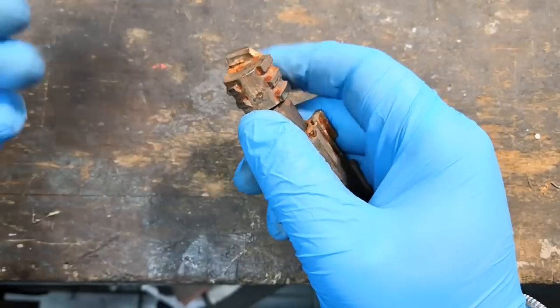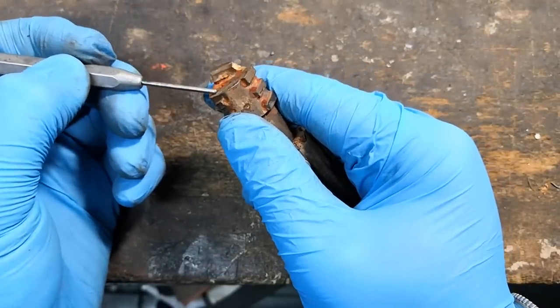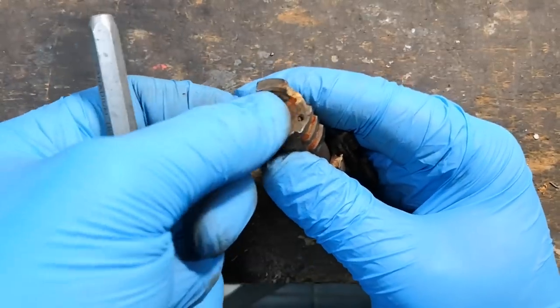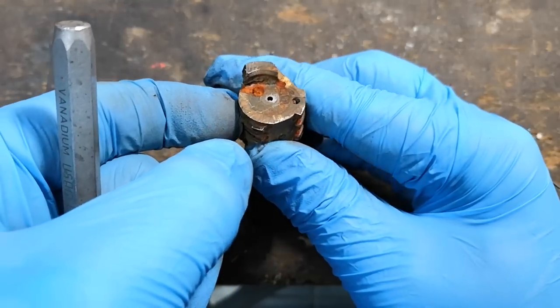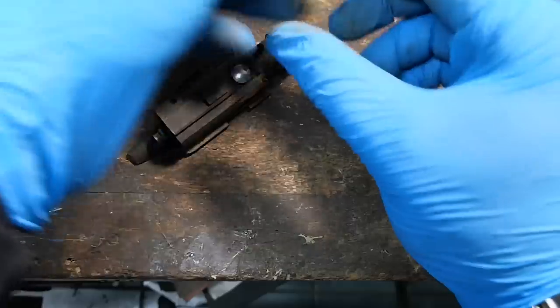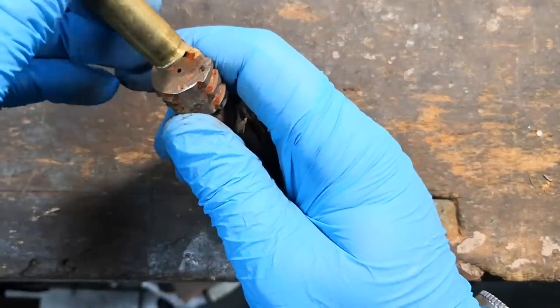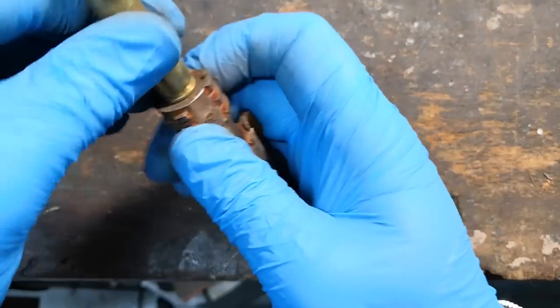We know that the rifle had already fired many rounds before the accident, and had been regularly proof-tested to a pressure 25% higher than the maximum allowed for the cartridge, so the yield strength of the material must have been adequate — otherwise the bolt would have started deforming during the first few shots, seizing everything up. During the accident, however, the bolt head was heavily plasticized and the case head actually imprinted itself into the bolt face.